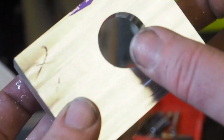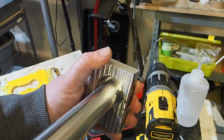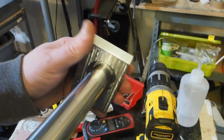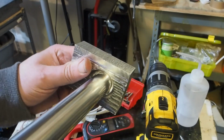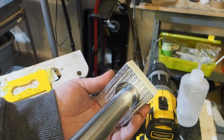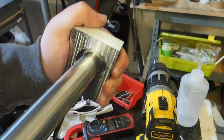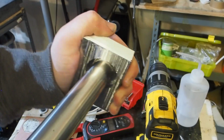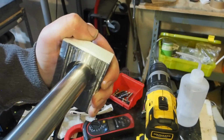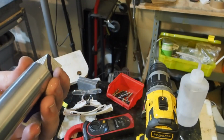So I just have to deburr it. I want to see if the bar fits. It's too tight. So I think what I should have done is, instead of changing the step count, I should have just programmed it loose, a looser fit, and use the sleeve compound.